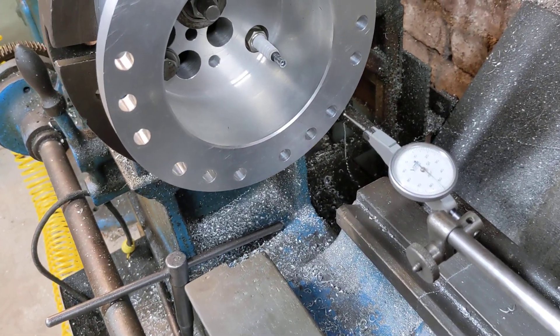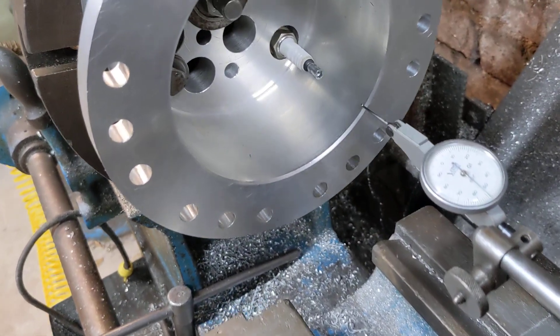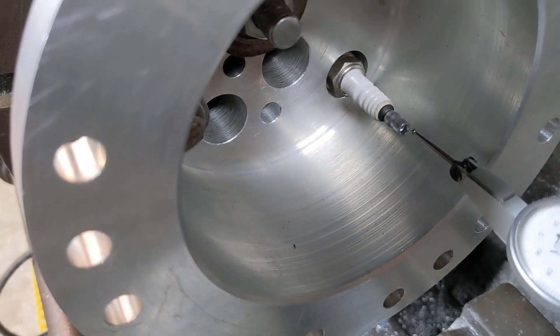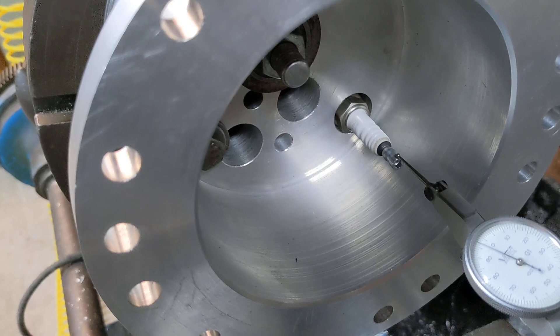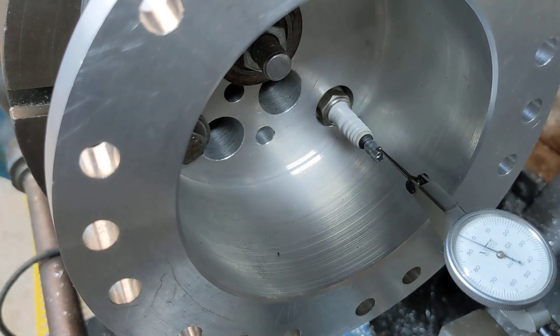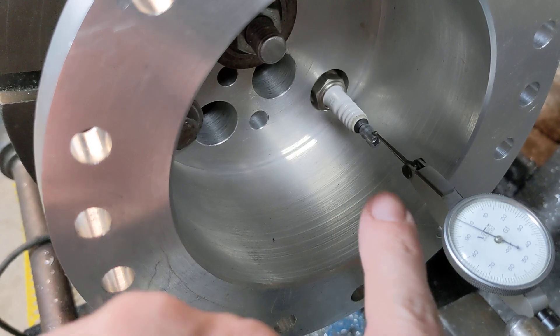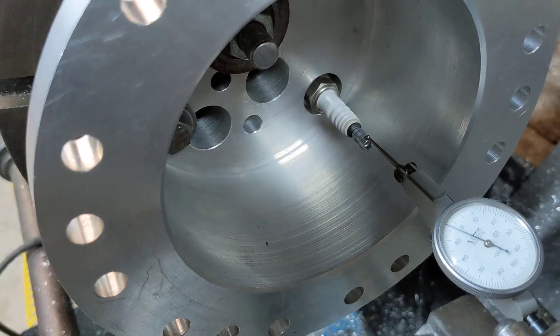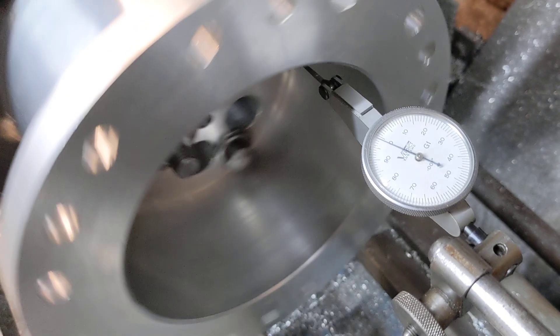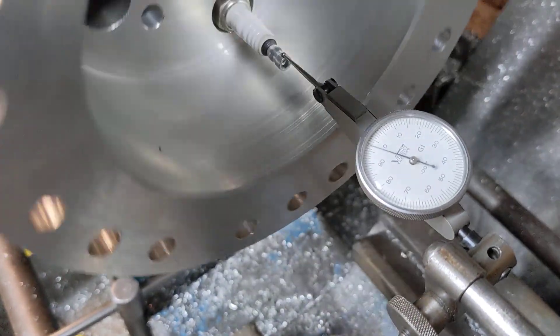So slide forward — this is a two-handed job. I don't want to break the nose of the probe, so I just pause the camera like that. It just needs to be lifted with one hand while you wind the handle with the other, so that the probe doesn't crash straight into the end of the sparking plug. So what we do is we give that a turn round.